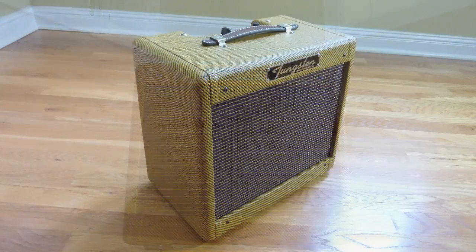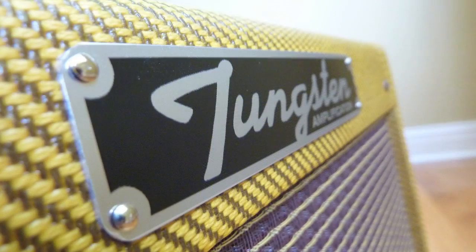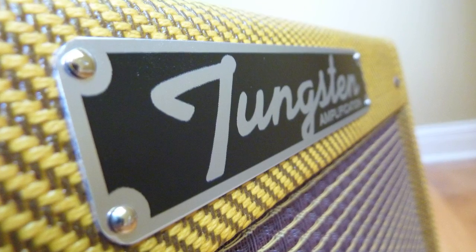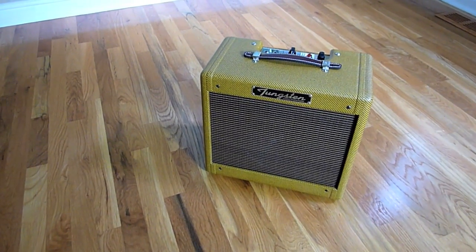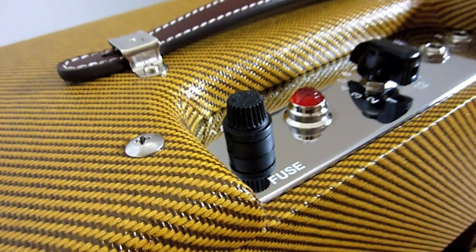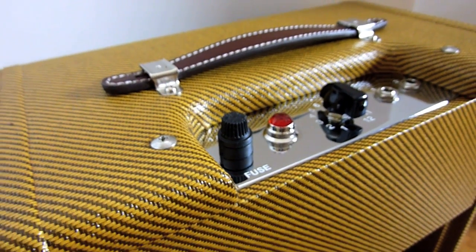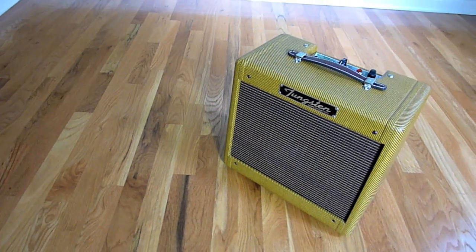And you were just watching me play through the Tungsten Mosaic amplifier. And in a moment, I'll be showing you a range of tones from this rock and tube combo. The Tungsten Mosaic is a 7 or 9 watt design, depending on whether you use a single 6V6 or 6L6 output tube. Supremely refined in concept and based on the timeless 5F1 circuit, the Mosaic's single-ended true Class A design